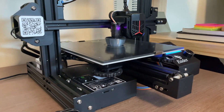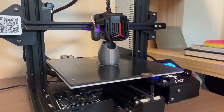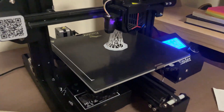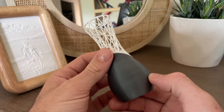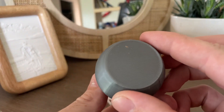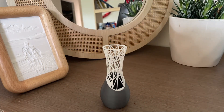Here is the one-and-a-half hour mark — as you can see, it's come along quite nicely. And here is the two-and-a-half hour mark, so nearly finishing up on this print, which is amazing — it's looking really good, no problems with the base. Here is the top I tried to repeat the process with — as you can see, it did not come out well. Essentially it was stringing a lot, which meant my temperature was too high. I reduced my temperature down to 185 degrees, and the results are a lot better and a lot cleaner.